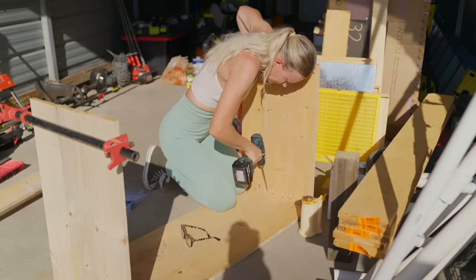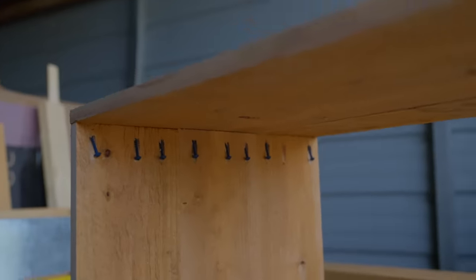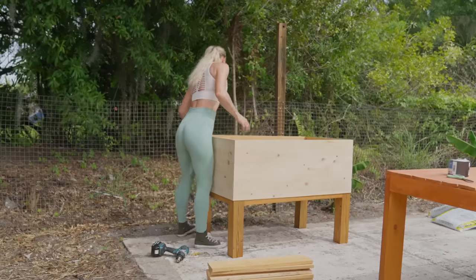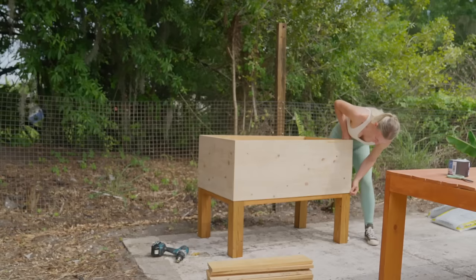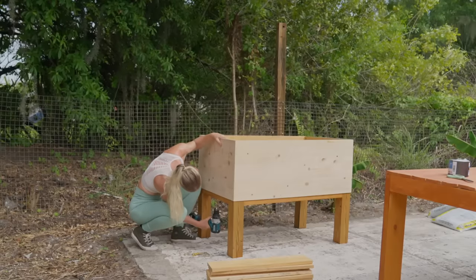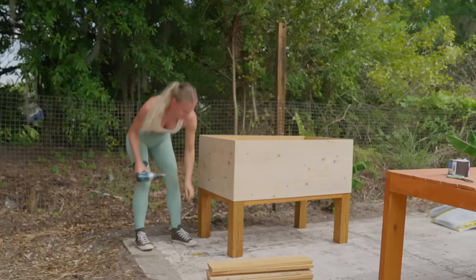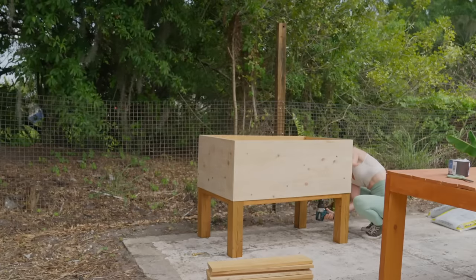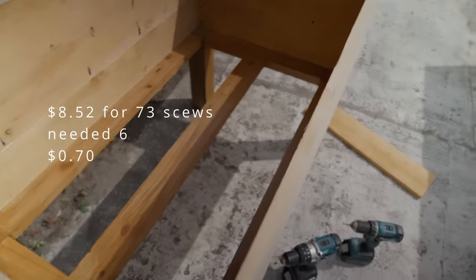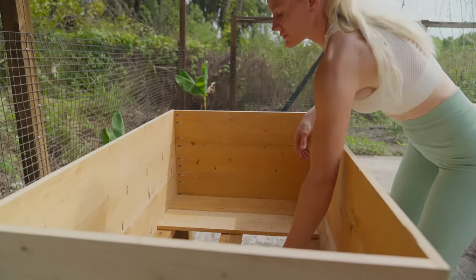It's easier to pre-assemble all four sides individually first and then screw them together. I did the same for the rest of the sides to get a rectangular box. This box I placed on top of the base, then used screws to attach the box to the base. Make sure the box is lined up perfectly, and center the screws so they don't come out the sides. I used six 3-inch exterior screws — $8.52 for 73 screws in the box, making it $0.70 for this build. Once everything is attached, put in the floorboards, and the garden box planter is ready assembled.